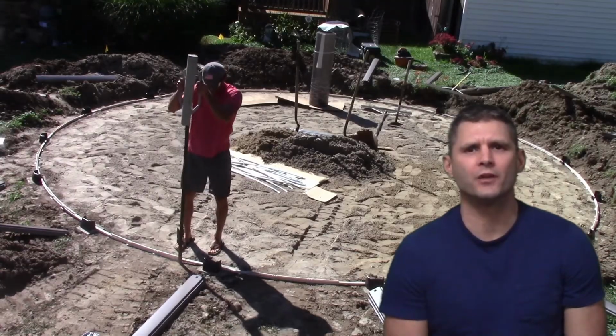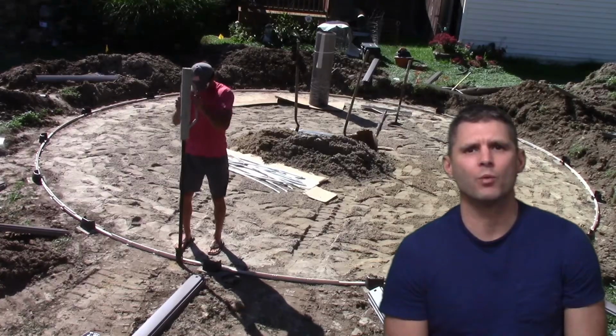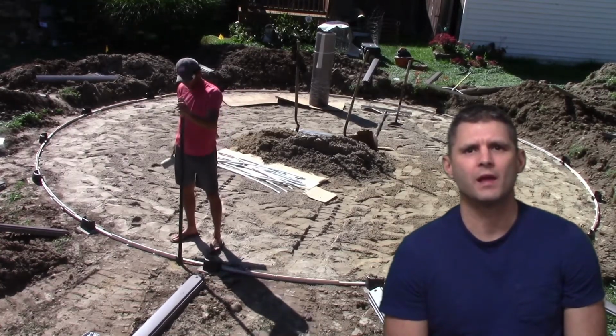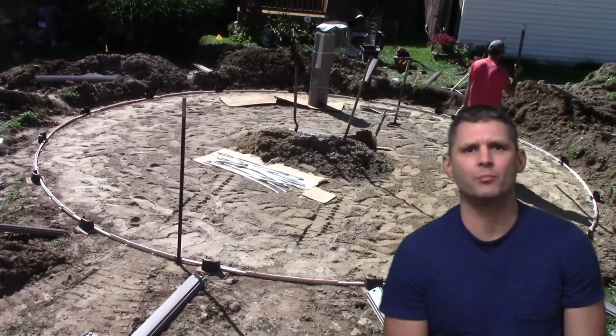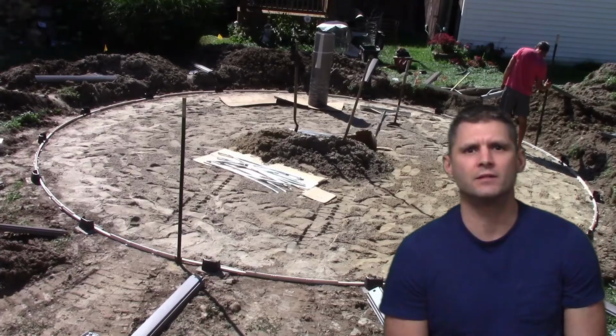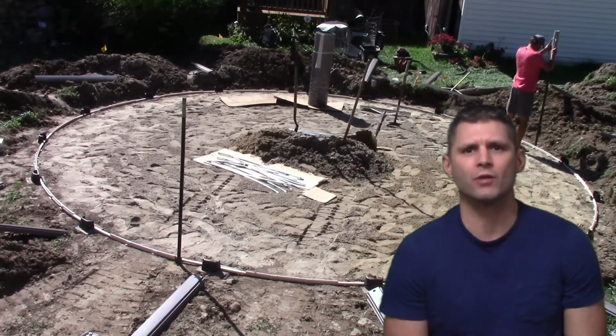If you are in the process of rolling out the wall and discover it is too windy and want to wait for a better day, roll the wall back up quickly, and you do not have to detach the uprights from the bottom plates as you go. Just be sure to detach the bottom plate and upright from the track and place it on the ground so it doesn't fall over and break the bottom plates or track.